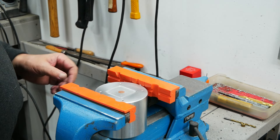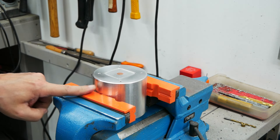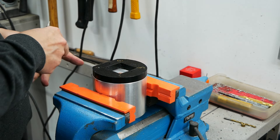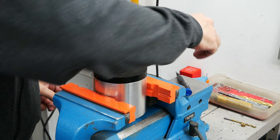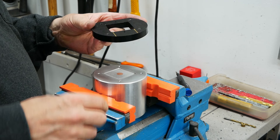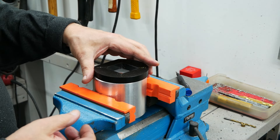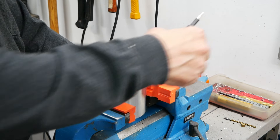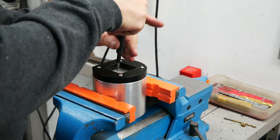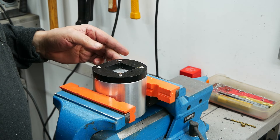Let's try this out — put it together. Here are our alignment arrows. We need to drill those out to M4 before we can do anything. Going over quickly to drill those out. I already made markings for the cable channels — we'll machine those in after we verify everything is working. Let's screw this on — all right, looking good. We'll see each other on the assembly bench.